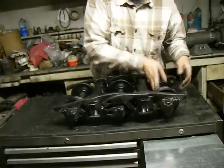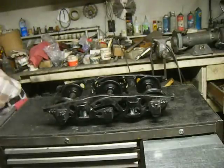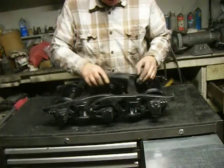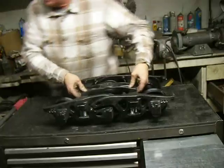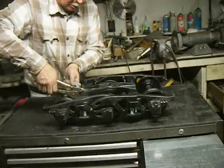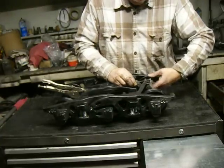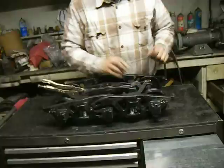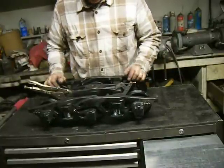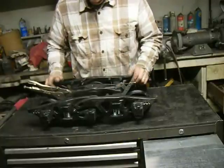Turn it over, right side up. Take the spreader, set it here on the flat — machine flat — like this. Plant both ends, and drill and tap eight holes, four and four. No specific location, just at random, four and four, and it's done.